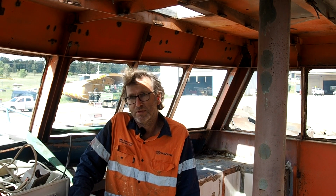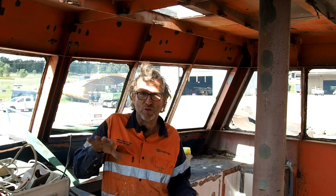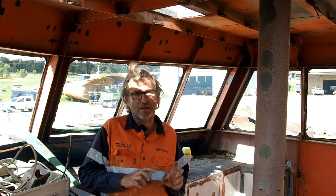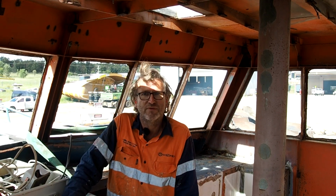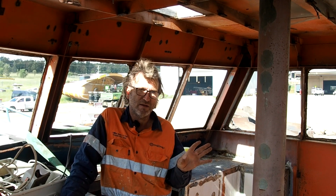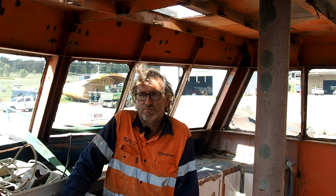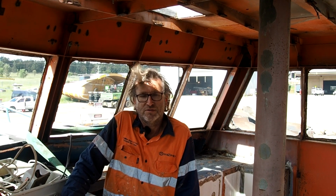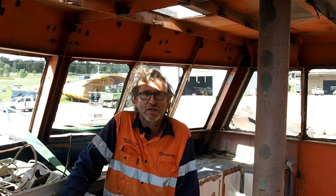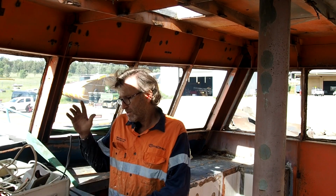Right, so what I'm up to today, I'm just finishing off those loose ends that need tidying up. Those two plates that I put in the forward section haven't quite been butted up yet. So I'm just going to pull them into line and make up some new stiffeners for them and hopefully get them welded in. That should be my plan. And then I just need to tidy up around the boat. There's a lot of stuff that needs to be put away before I go in and leave this baby for a few weeks where I can't get into it.